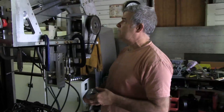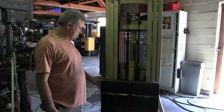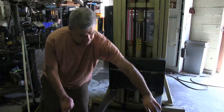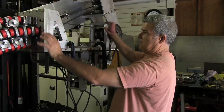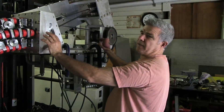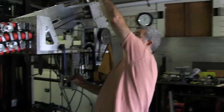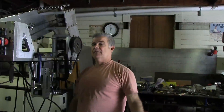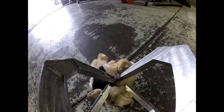This unit here creates what's called compliance, and that keeps the thing from breaking apart when it winds itself up near its limit in one direction or the other. So this is going to be the basic mount for it — it'll change quite a bit — but essentially these forks will come off, and there'll be a mount that comes out here with a pivot on it, two mounts and a pivot right here. This whole unit will be able to go from about 120 degrees, almost pointing straight down, all the way straight up. So you'll be able to do the whole bullwhip thing with it, rotate it around up in the air, and it'll also be able to dip down to be a little more maneuverable for picking up stuff.